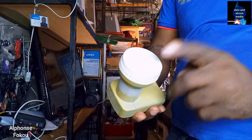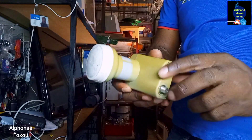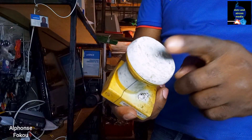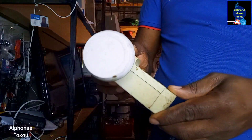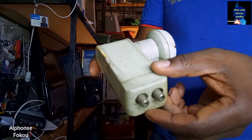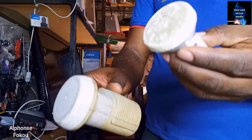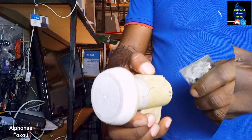This is our LNB — this front and the box. When the box is cracked, it's not actually a problem. But if you got a problem with the front, if the front is cracked, it's not good. If your front cover is damaged, water will get inside your electronic part. If it's the box, you can still use it — the aluminium is protected. But the front is still good, let me open it so you can see the inside.